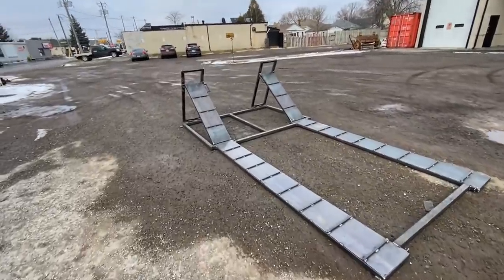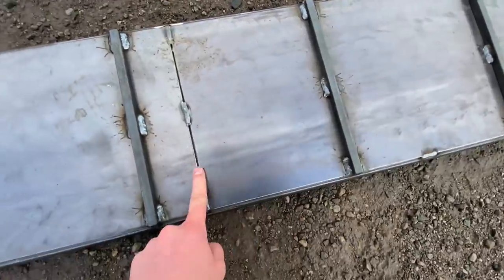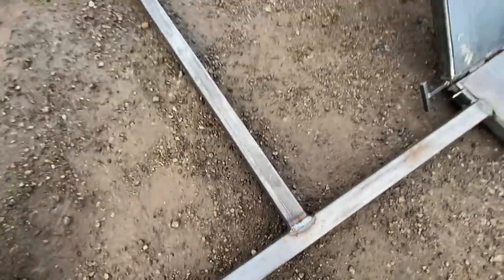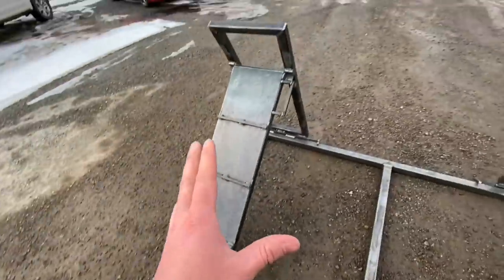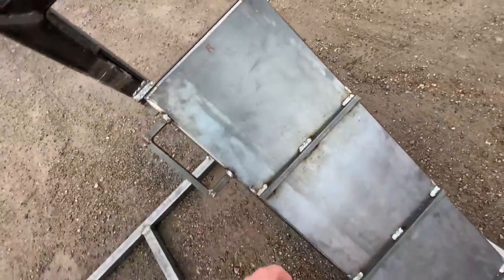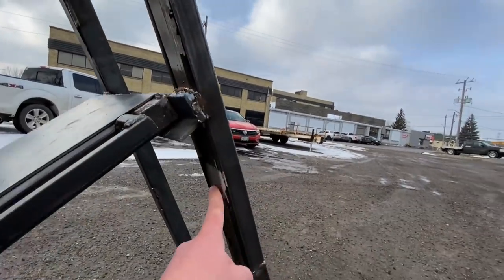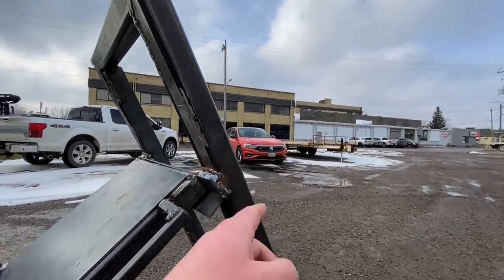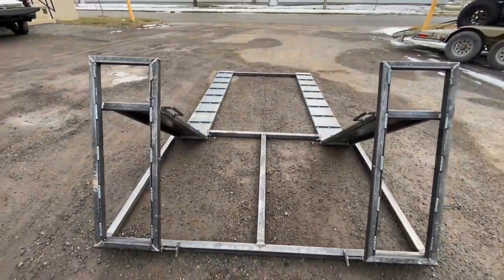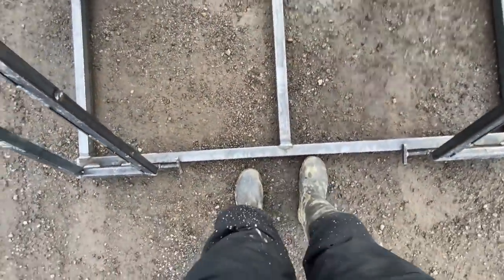My straps didn't fall off, that's good. So this is the ramp — if you saw the other video, she was definitely not as beefy. You can see where my tires were spinning before because this was all flat. These are way more beefed up — they were half the size before and this whole thing was just bolted together, it's now welded all together so it's pretty heavy. We got grip on here now, and we got some handles so it's easier to lift. It took three attempts to get the height right — too low it was popping up, too high it pushed over, the middle was perfect. We need a hole drilled in here too so we can strap her down.